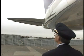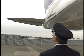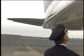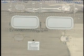Next, look at the leading edge of the horizontal stabilizer — it should be clean and free of damage. Verify that the aft cargo door is closed and locked. The pressure relief doors should be flush with the surface.